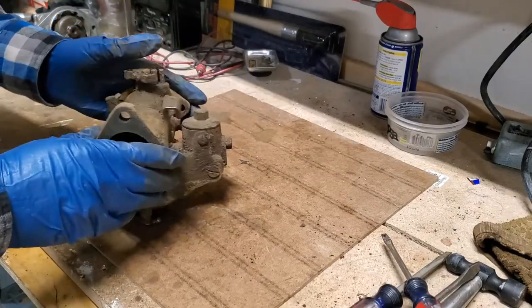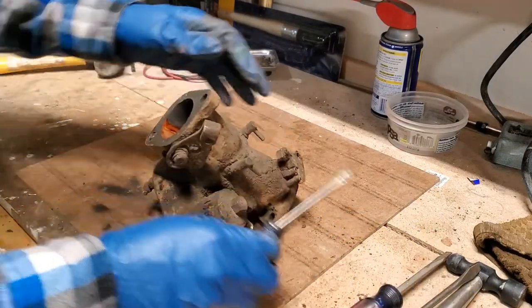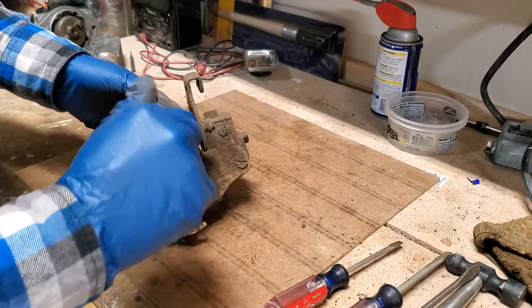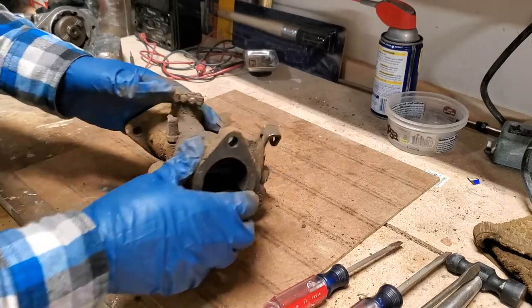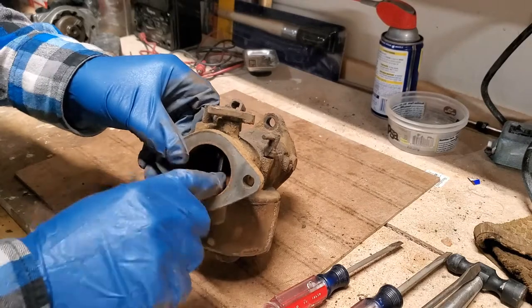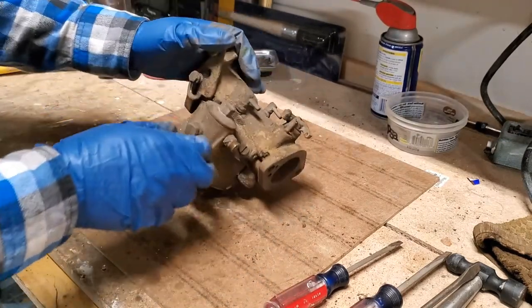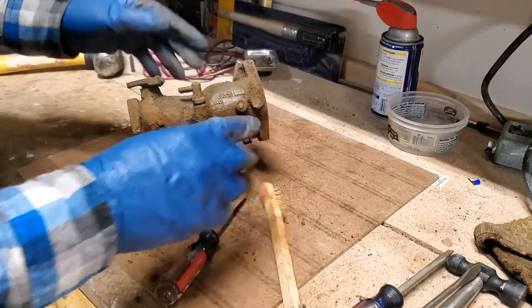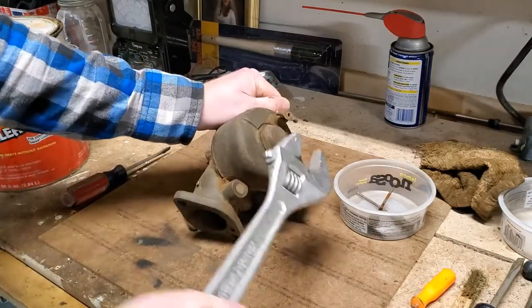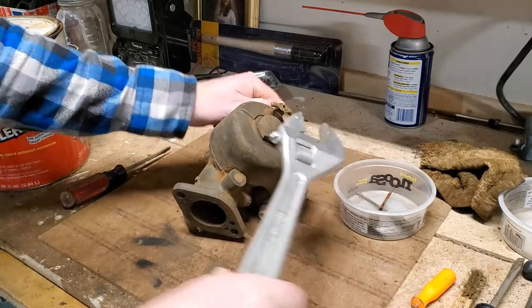What I want to do now is just take apart this carburetor. This is what was on the tractor — you can see it's filthy dirty on the outside. On the inside we've got a little bit of fine rust down in there, but not too bad. This is the choke side and this is the engine side. Not too bad, you know, for something that you pulled out of a field. I'm just gonna clean off all this dust and grime and start taking it apart. Once it broke free it's turning nice and smoothly.